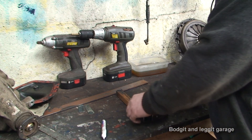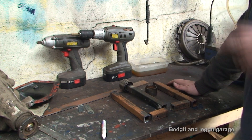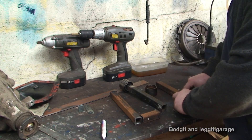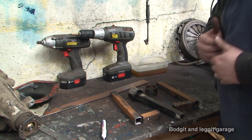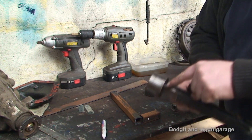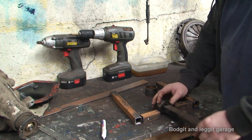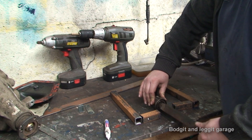I've just cut everything to start — there's no point showing that on camera, it would just be boring. I've got a couple of arms here and I'm going to weld these little tabs on the two arms in the middle, because I need this to be able to turn 90 and 180 degrees. I've cut down the sides of each edge on this piece so I could fold the metal in, as you can see, so I can fit the bearing. The bearing will be mounted on a plate and allow me to spin the whole thing.